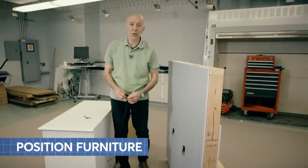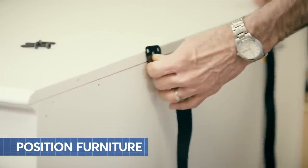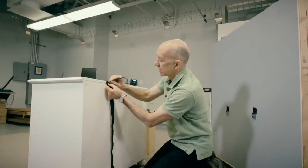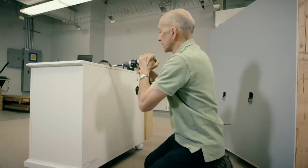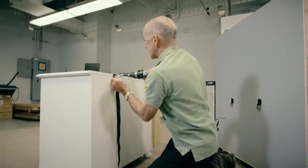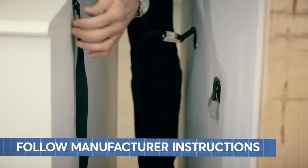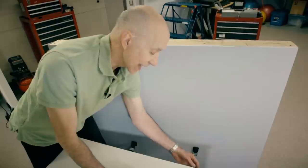Now that we have the brackets attached to the wall, it's time to locate the furniture. You don't have to center the dresser on the wall anchors — there is some flexibility, and it's okay if you place it a little off center. The manufacturer recommends always anchoring the bracket in the furniture to solid wood pieces, so you want to go into a top solid piece. It's really important to follow the manufacturer's instructions — in this case, they want the short anchor attached to the wall and the long strap attached to the bureau, and the brackets need to be oriented in the proper fashion so the anchor works properly.